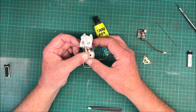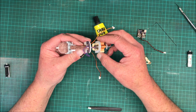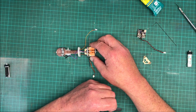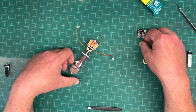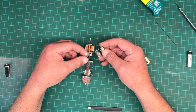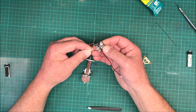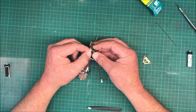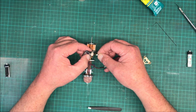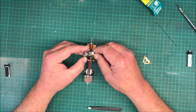So where does that leave us now? Okay, so they're in. Now this is the part where, even though it's not in the instructions, I check my electronics. So I took the receiver, and there's an interesting point here, by the way. I plugged in the, now you've got to get this the right way around, because if you don't, you're going to break it. Put that in there, and the other one goes in that way around. Push fit them in.